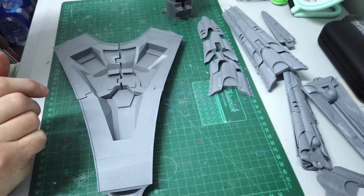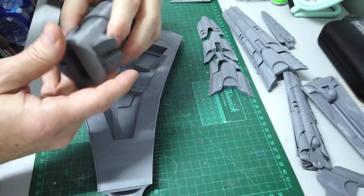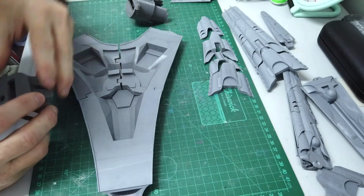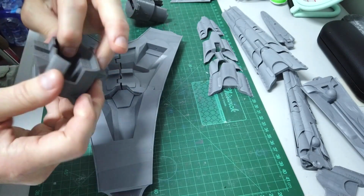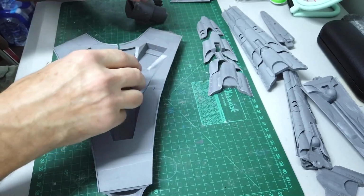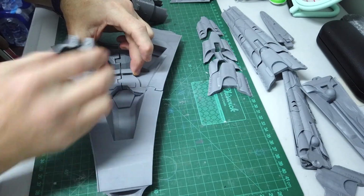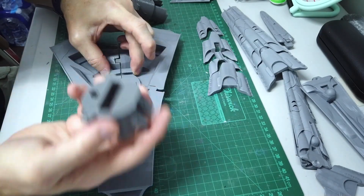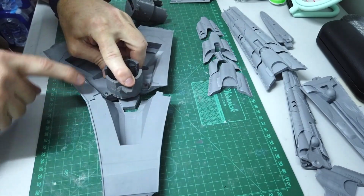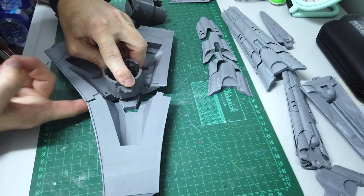Okay, so in saying that, the rest, let me just get back to this piece. If this was your bottom part, you'll see there's a notch on the inside, and on the FDM printed part there is a little piece that sticks out, and that basically just goes in. Okay, and there is a little plastic thing that sticks up, goes into the bottom gap. Okay, and then this hole is actually exposed through the bottom. As you will notice, there's a little space there to drill a hole through, drill it right through the body, and then tap it up at the bottom.